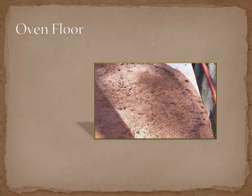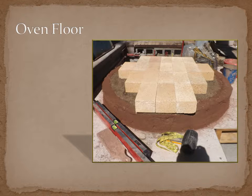Basically, the bottles act as air pockets that will hold the heat longer and permeate into the surrounding adobe. It's fully enclosed so the oven base and the outside do not steal the heat and reduce the efficiency of your oven. Fully enclosed, it's time to lay out your oven floor of firebricks and visually see the layout. Spend some time maneuvering and see what works best.